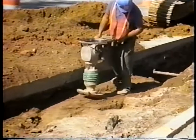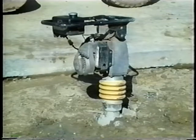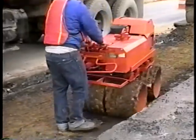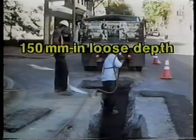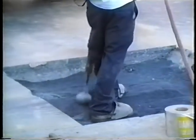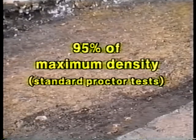Traditional soil backfill means that compaction is still a key issue. A variety of equipment is used to consolidate backfill layers — most often, manually operated gas-powered or pneumatic-powered tampers. But larger self-propelled equipment may be used where trench size permits. Regardless of the equipment, the backfill should always be placed in layers or lifts about 150 millimeters in loose depth. Each lift is separately placed and compacted right on up to the top of the subgrade. The goal is to build a dense mass of fill that will not later settle under its own weight or from pavement or traffic loads. Typically, agencies specify that utility cut backfill be compacted to 95% of maximum density, as determined by standard Proctor tests.